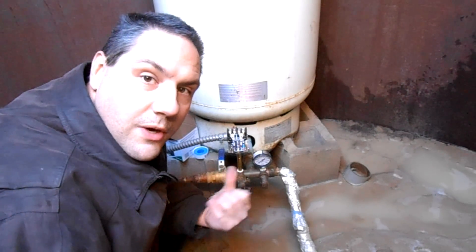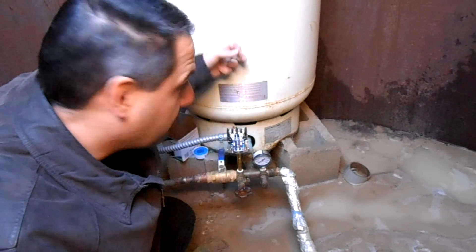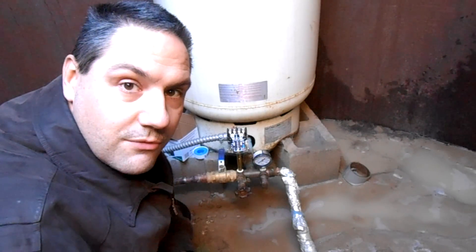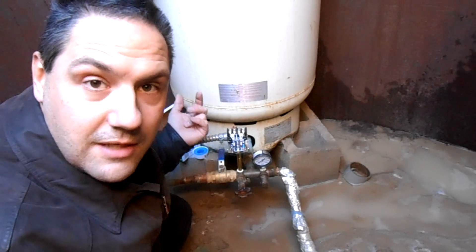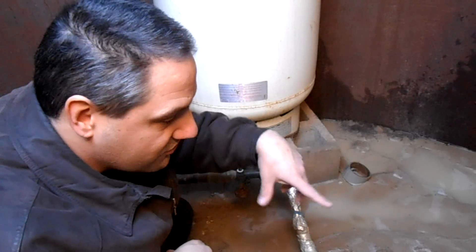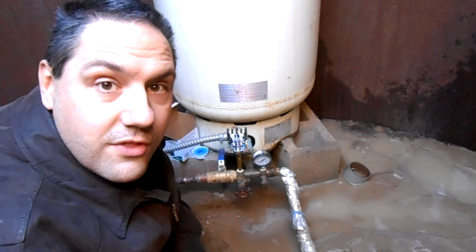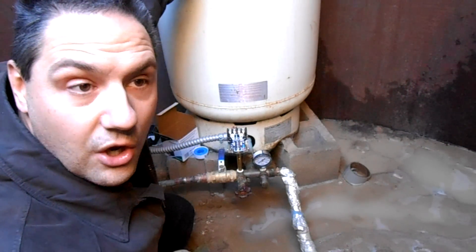Now we just put the strain relief back on and we're all set. Normally after replacing a pressure switch you'd just hit the power and pump the system back up, but we don't want to do that yet — and part of the reason is the pressure tank. It works like a straw. By opening the system up like that, we allowed air to get pulled into the pressure tank, but at the same time there's still water stuck in there. Like a soda straw with your finger over the top — when you lift it up it holds the liquid. The same thing happens with the pressure tank.